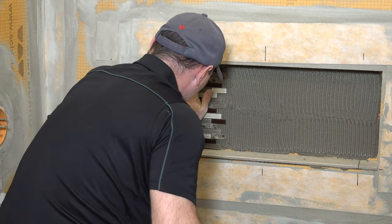A lot of mosaics are mounted on a mesh backing or something like that, but sometimes the odd one of them is a little crooked, so I usually just have a little look and make sure that everything is going to sit there alright and look pretty square. Make sure these bottom ones are pushed in. So now I like to do my top piece and then fit my sides in between.